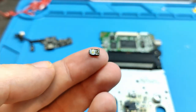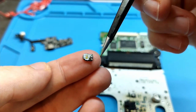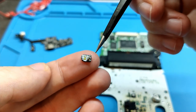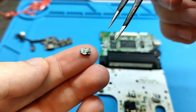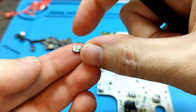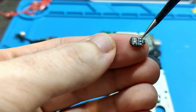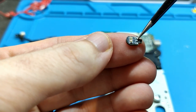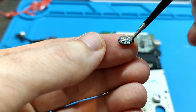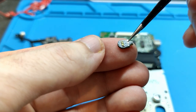The old one has three lights, and the one on the right has a resistor, and it's too near to the place where you need to solder the cables. So in this next version, I put this resistor smaller than now, and I put it in another place next to the lights. Now it's here. I hope, because this happened with some people, that when you solder these very, very small pads with the cables, you don't touch the lights and you don't desolder anything.